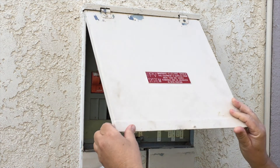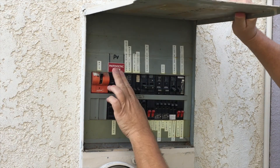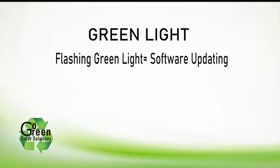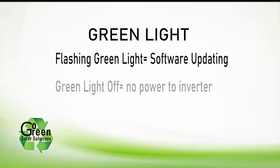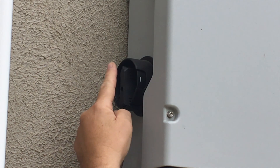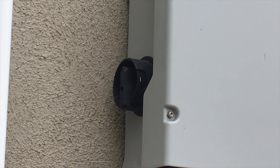One quick solution for this is to check the AC breaker in the main electrical panel and switch it on if it has been tripped. If the green light is flashing quickly, the inverter software is being updated over the internet. If the green LED light is completely off, the inverter is not getting power from the solar array on the roof. Please check the DC disconnect on the upper left side of the inverter and make sure the round disconnect is in the vertical position, or the on position.